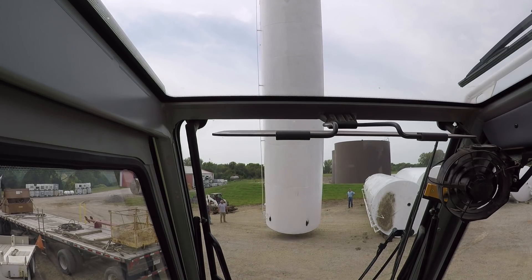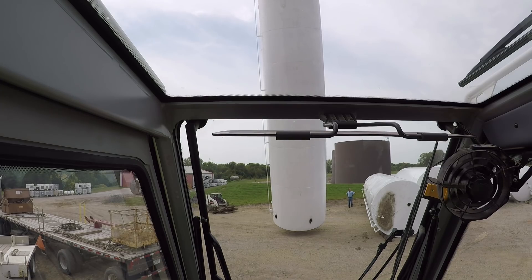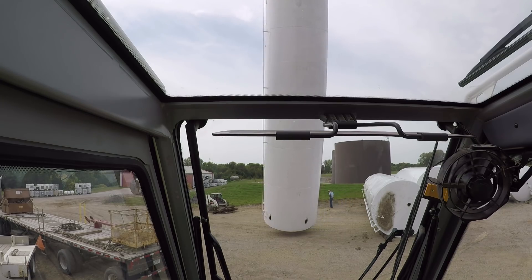These tanks in particular happen to have engineered and installed tailing lugs at the bottom. Not all tanks do, some do, but that gives you a point to attach your auxiliary winch to hoist the bottom of the tank and set it out horizontally.